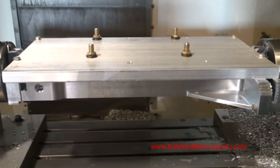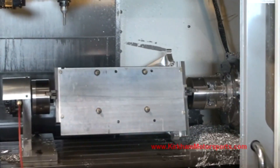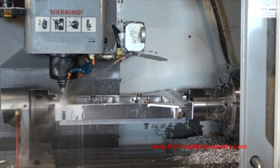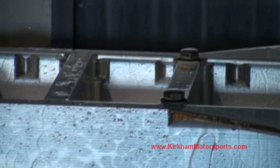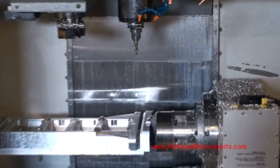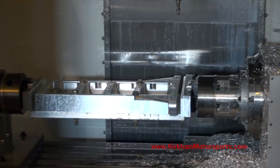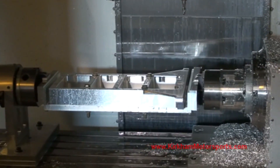When we roll it over, we're going to finish the machining operations and then we'll deburr. Here we've cut the girdle away from the parent material — it's still bolted down to that fixture plate. We've changed the end mill out to the ball mill, and we use the ball mill to do all the deburring. We're going to run right around the edges of the part to take all the burrs off so it's nice and finished when we're done.